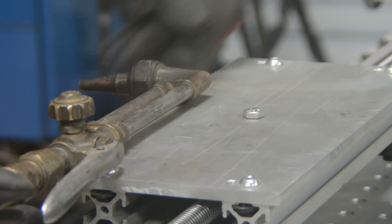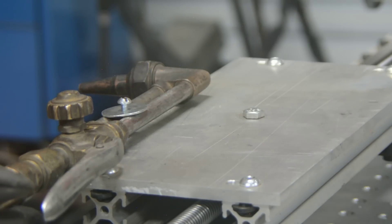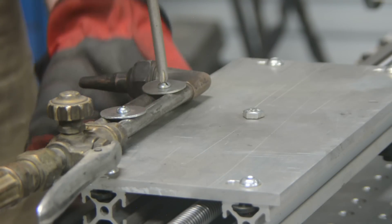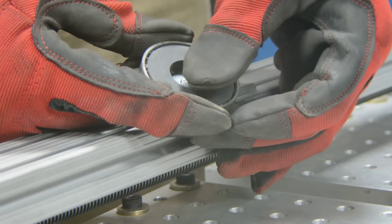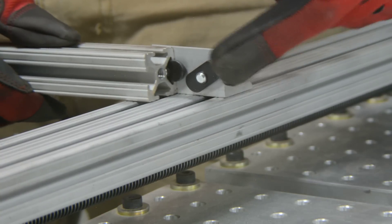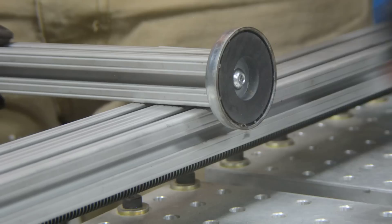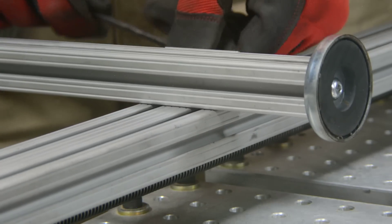Mounting my torch was easy — it has two mix pipes that I was able to pass bolts between to hold the torch in place. The feet for the track were made with magnets and a bolt mounted to the bottom of some 1x1 extrusion. The extrusion had a quarter-twenty tapped bottom and was bolted to the rail with a 90-degree bracket, giving two directions of adjustment. The magnets will attach to the plate I'm going to cut or a steel work table for trimming and parting off of thick plates.